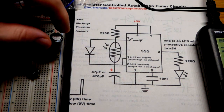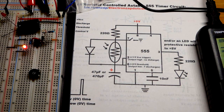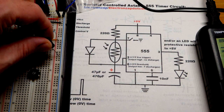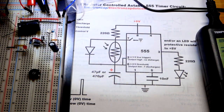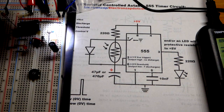Now I can pop out the capacitor and put in a lower value capacitor and it will go faster. This is a 47 microfarad capacitor. There, you can see it's going faster just with the regular light. I get the flashlight on it, zoom in, and even faster there.